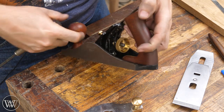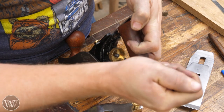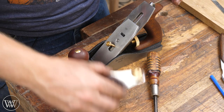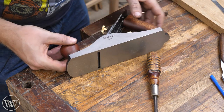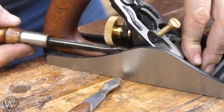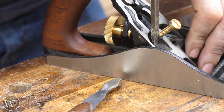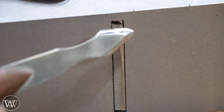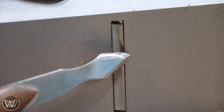Drive the frog forward. In the back there is a screw underneath the depth adjuster that allows the whole frog to move forward and backward as you turn it. Drive it forward a little bit — if it's too tight, loosen the two frog screws a little more. After moving it forward, reassemble, check the iron, pop it all in, tighten down the lever cap, flip it over, and look at the mouth again. In this case — ooh, now it's too tight. So you take it all apart, loosen the frog, adjust it back a little bit, check it, tighten it down, and put it back in. You're going to go back and forth quite a few times — it took me about six times with this Bailey pattern plane. But once you get the hang of it, after going back and forth several times, the mouth is really nice and tight — just enough space for a couple of shavings to get through. That's what we're looking for: a nice, clean, tight mouth all the way across.